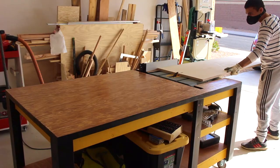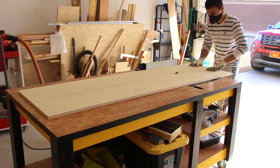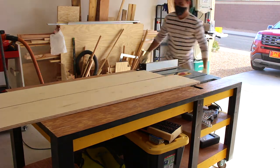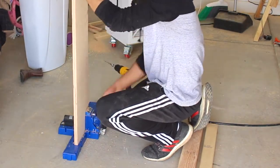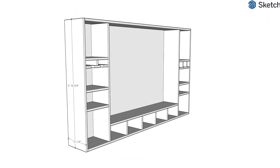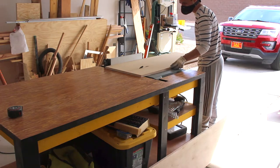This is going to be the top and the bottom. The top and bottom panels are 76 inches by 10 inches. You will need to cut two of these panels from 4-by-8 plywood. I drilled about six pocket holes on each side of this panel.